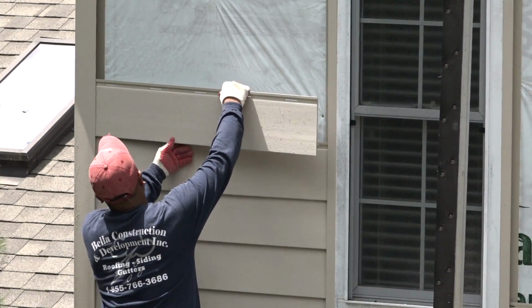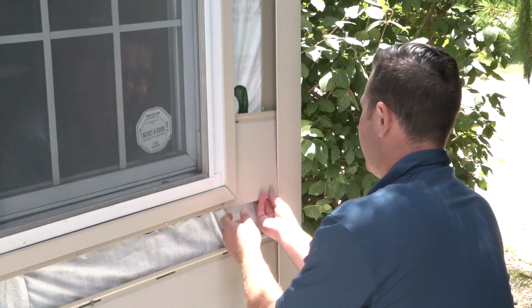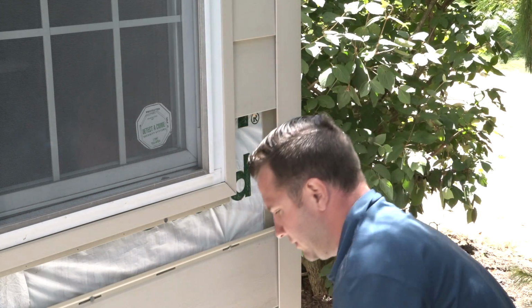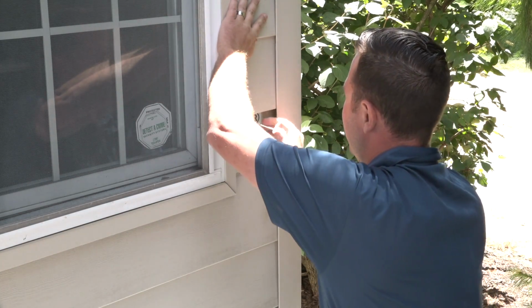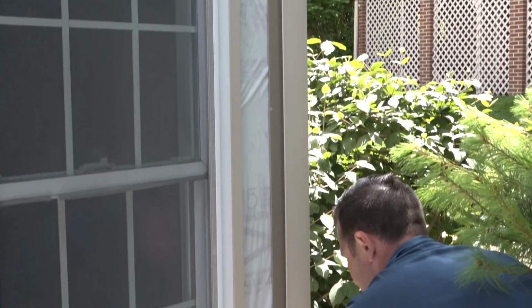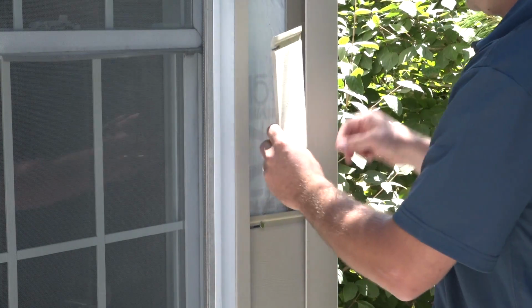Everlast planks are designed to flex. However, there may be instances where the distance between trim is too narrow to effectively flex a plank into position. In these situations, you'll want to preload planks. This can be done from the bottom or from the top. If it's impossible to preload planks from the top or the bottom, trim the plank just enough for it to fit past the trim.